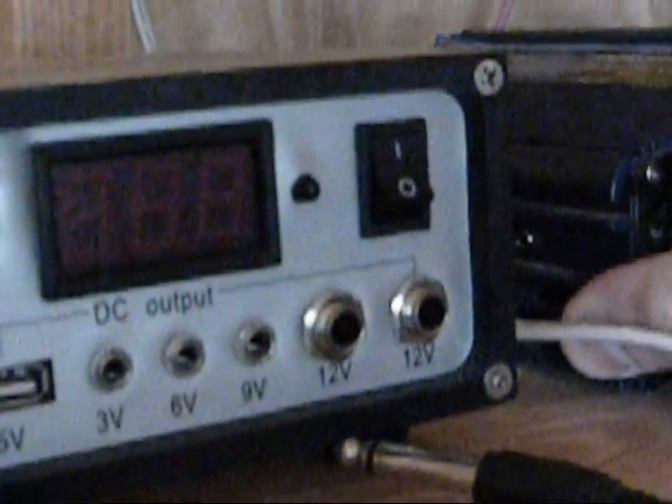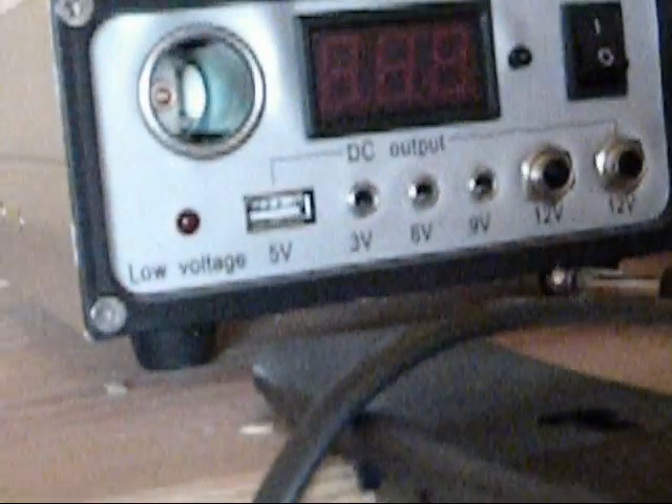From the regulator, these two wires go to the battery. I just have one deep cycle RV battery in the shed. And from the battery it goes to my very small Chicago Electric Power Inverter, which takes the DC from the battery and makes it AC. That seems to work pretty good — it runs drills, charges the weed whipper, runs the jig saw. It won't run your bigger stuff like a compound miter saw or a table saw — just too much power. But other than that, that is the system I have for the wind turbine.